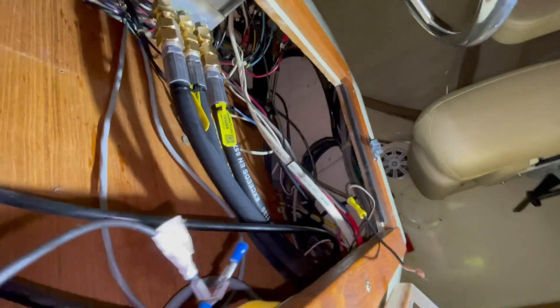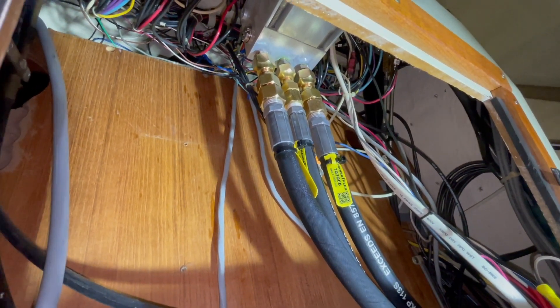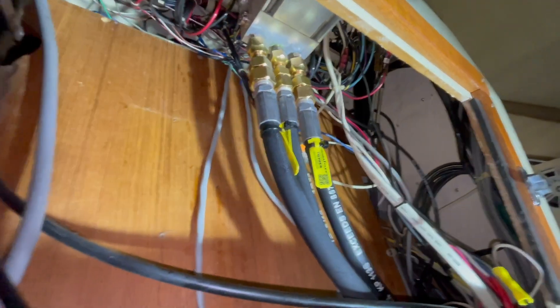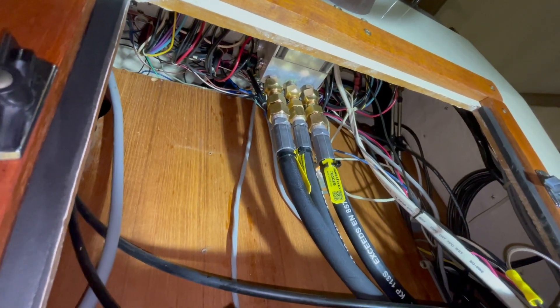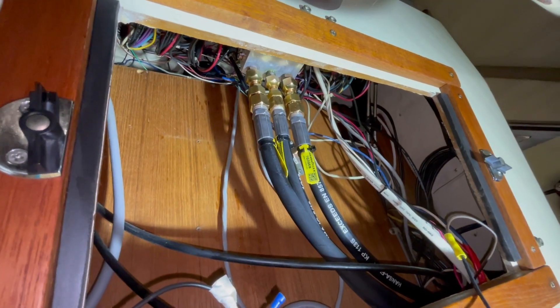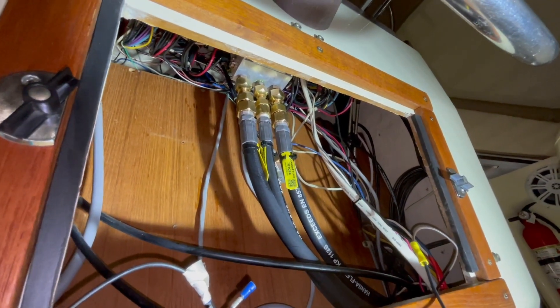We got the system all bled and got everything pretty much cleaned up. There will be some more fluid to clean up because it's really hard to get all the fluid from inside these areas here — fluid's going to continue to drip down, but nothing leaking out of the purge plugs. We tested the steering; Kevin went down and checked the rudders and they move as expected in the correct direction. Because it is possible if you got the starboard and port lines — the two outside ones — backwards, your rudders are going to move in the wrong direction. So we verified that. Now I'm going to go back down to the engine room and bleed off just a little bit of the pressure because we're still in the high 30s. Operating pressure for the system is between 20 and 30 PSI.